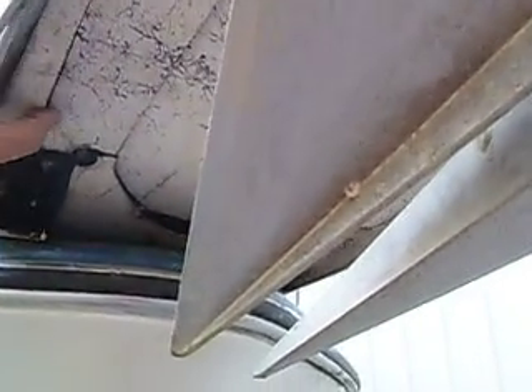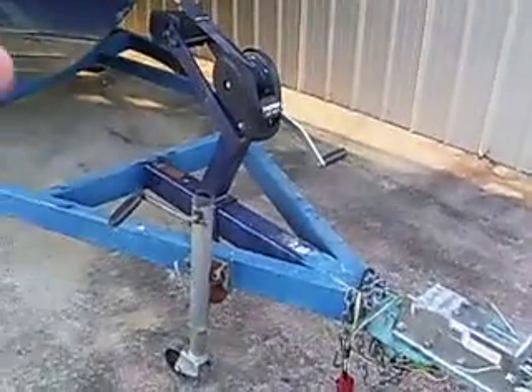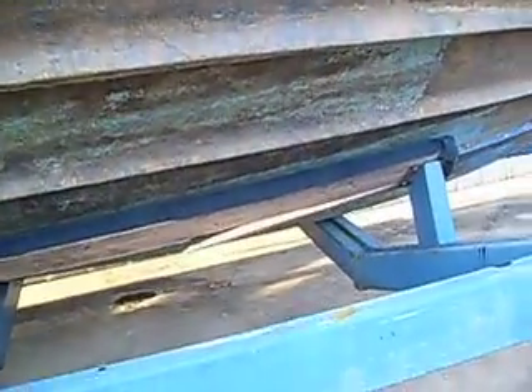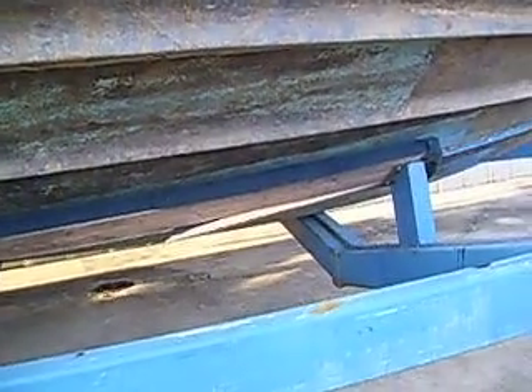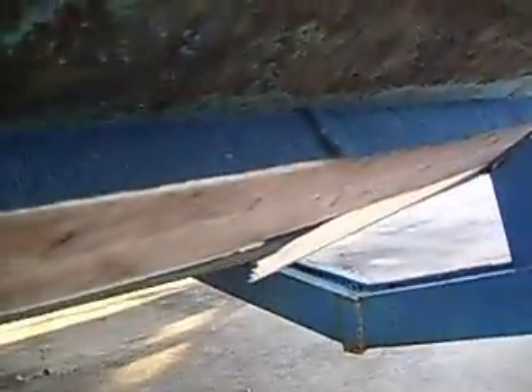While I'm at the bow pulpit, these are some items. I tried to remember everything when I made your list today and sent it to you by email, but I didn't remember everything. We've got soft wood in the bow pulpit, and the bow pulpit moves quite a bit, so there's some repair there as well. I would want to move this bow stop forward. We have one cracked plank — the plank is cracked but by and large intact. It's up here on this front bunk, and the crack is just a sliver off the side of the plank.